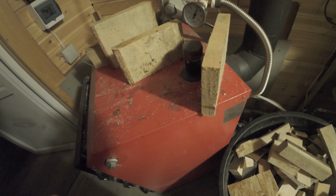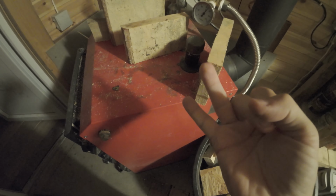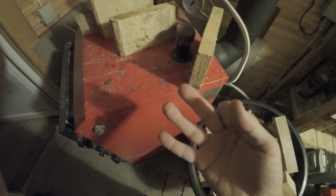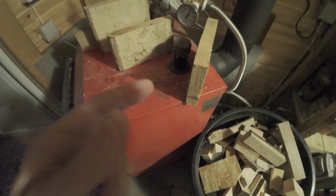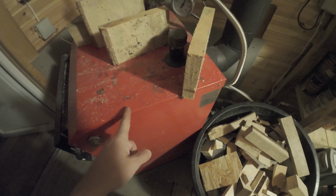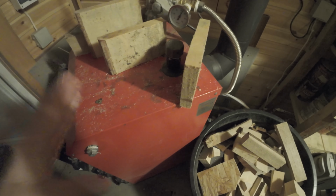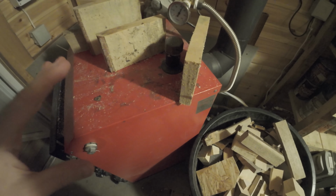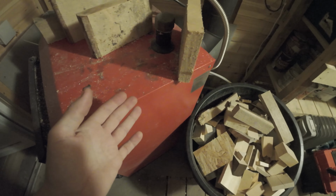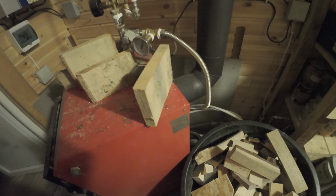So to summarize all of this, the accumulation tank gives you quality burning, temperature accumulation so you don't need to burn that much, cleaner combustion, like a cleaner burning process, cleaner chimney. Downsides, it costs more. In fact, even if you don't have the tank, you can easily overheat it just if you don't have where the excess heat can go. If you want to burn one full stove, you need at least 200 or 300 liters of cold water. It nearly will boil them. So if you have a system of only 60 liters and you don't cool it in any sense, it will start pouring steam outside of the system, so it could be really bad.